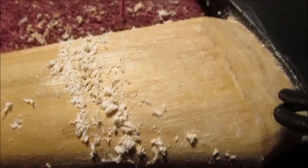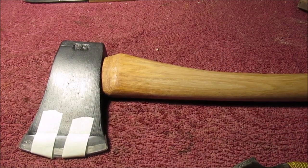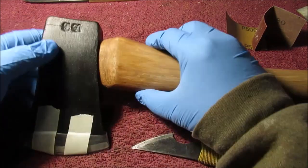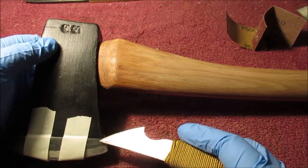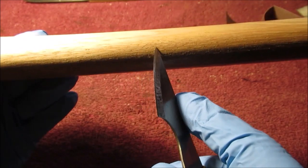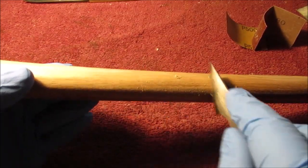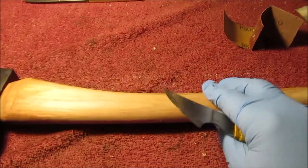Today's a new day. Let me show you my sandpaper. We've been scraping the varnish off — there's like two coats of linseed oil on here. This is the end grain; I want it to soak it up. Hickory is like little miniature straws — you might be able to see little bitty dots or dashes in there. It wasn't sanded worth a hoot from the factory — not complaining for the price — but it's not smooth at all. This came this way, with these nicks and gouges.